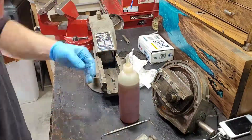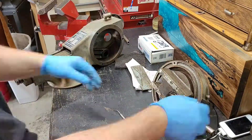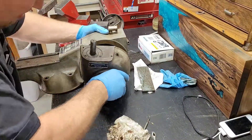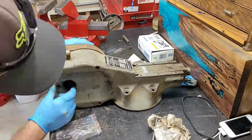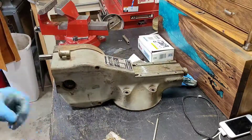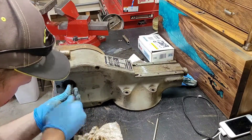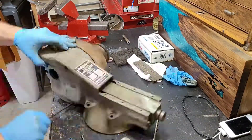So I got it all cleaned up — I used some steel wool to try to get the rust off without taking too much metal off. Now putting it back together, I'm going to use way oil inside that square shaft housing so you're not having metal on metal with no lubrication in there. We're putting that crankcase back together here — that's a cap that goes onto the crankshaft to keep those needle bearings in place on the connecting rod. Now we're putting the bolts back together.